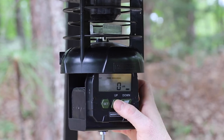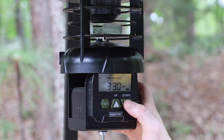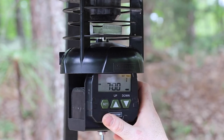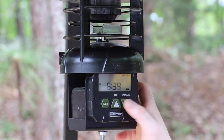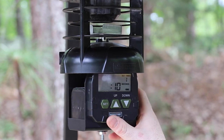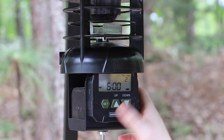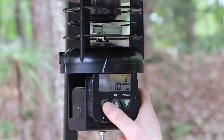This is going to ask us how much feed we added — we added 325 pounds of feed to our hopper today, so we're going to set 325 and hit Set once more. Then you set your first feed time — this is preset at 7 o'clock, but I want this to run at 6:30 a.m. Hit Set and let's run it for 10 seconds — this is the duration of how much it feeds at one time. Hit Set again: timer two at 6 p.m. looks good, and again we're going to run it for 10 seconds.